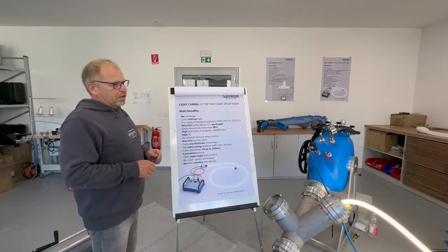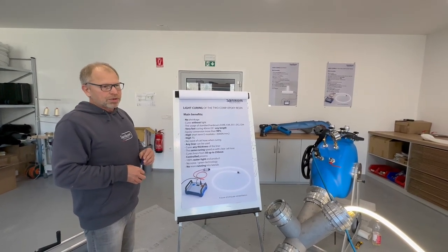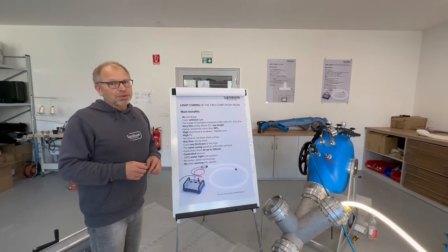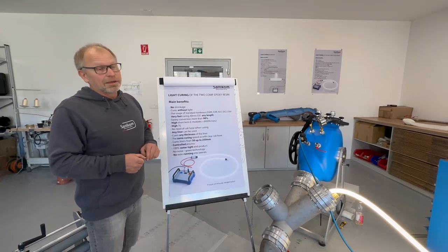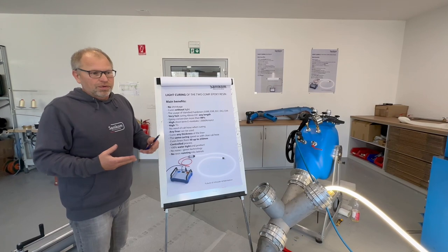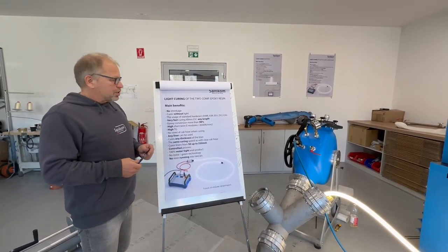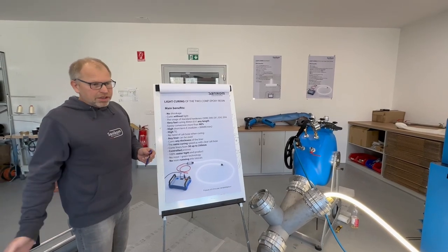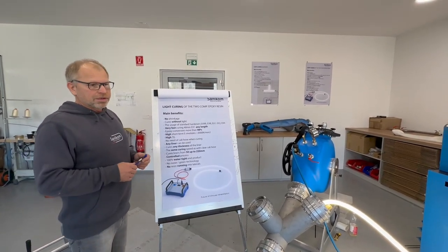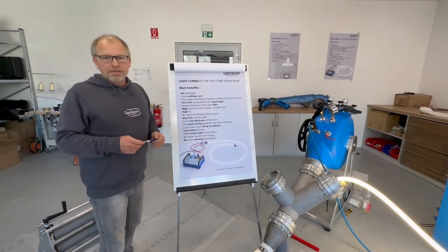Next thing is very, very important, because in the past, especially the people who wanted to do steam curing, they had to always use a calibration hose for curing, because the liner is not performed for steam curing. But here, you don't need any calibration hose. You can do installation and light hose in and cure. And here you also save a lot of money.